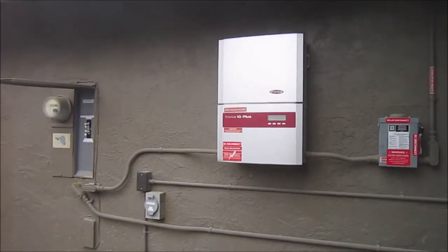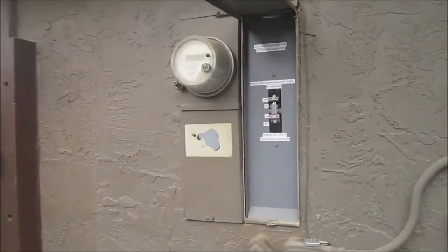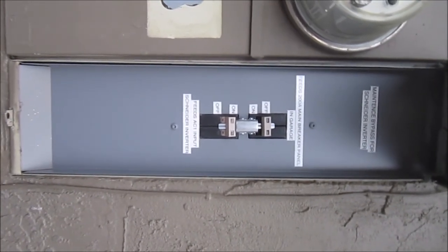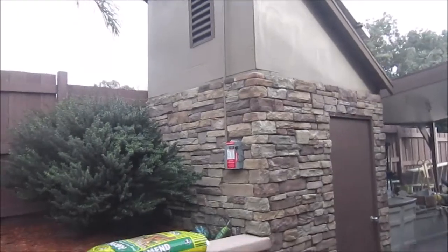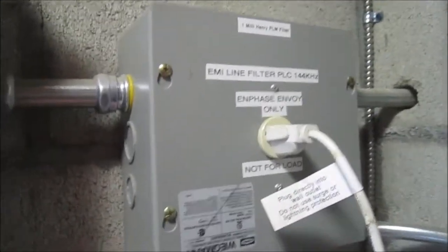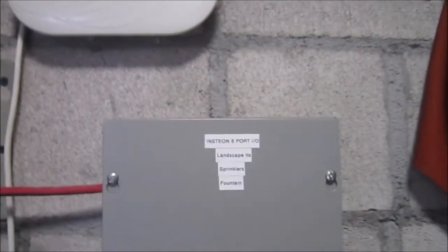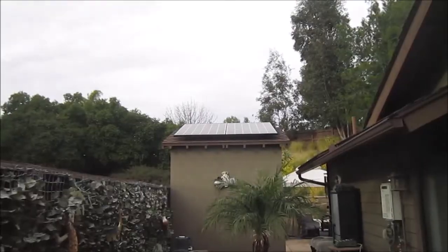This is the original inverter — SolarCity, a 3 kW Fronius disconnect. When I get inside the garage, I'll explain this a little more. I gutted this main panel and turned it into a maintenance bypass for the hybrid inverter. There's the same building disconnect, properly labeled. The 50 amp subpanel. This is my combiner box. I've got a line filter in here because this uses power line communication to communicate with the Envoy, which would interfere with the Insteon system, which is at a very similar power line frequency.